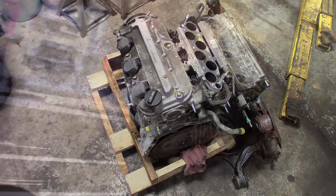Let's wrap this up. Just wanted to give a shout out to these tech angles. If you're thinking about getting these things, outside the cost they're great tools - well worth the money. You'll probably need to get them calibrated every couple years depending on use. With some of these new motors you've got to be precise on torques - you don't want to over-torque or under-torque something, end up having to come back, break bolts, especially with one-time-use stretch bolts. These tools are something I've wanted for a while, picked up about a month or a month and a half ago. One big tip: don't leave the batteries in when putting them up. If you're not using them for a few weeks, take the batteries out. For a tool that expensive, you also want insurance on them in case you drop one.